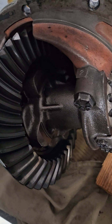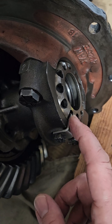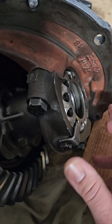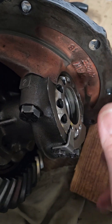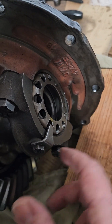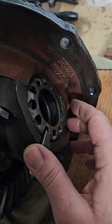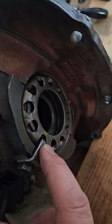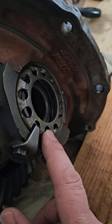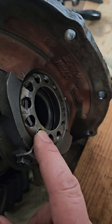What I did was I loosened this and went one notch back. You can't just loosen and stay there — you have to loosen and go back in, because you always want to stop while you're tightening. So I backed it out to where it spun freely at one end, marked it, and noted where it was when it was too tight with the excessive backlash.